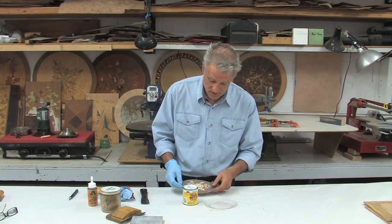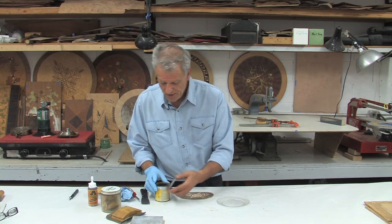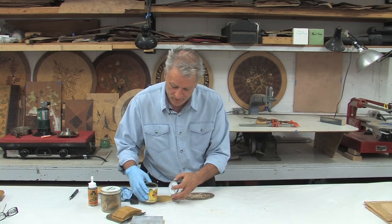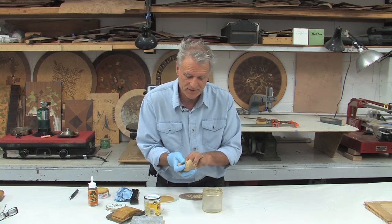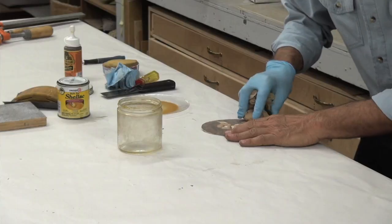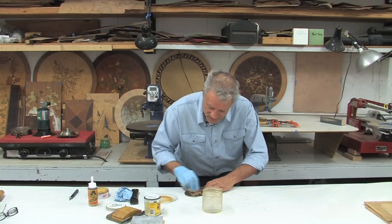Now it's time for the final finish. I'll seal up this piece like I do all my furniture with shellac. Shellac is a natural substance, alcohol soluble, and I use this Bullseye Clear Shellac, which is quite good for sealing up my veneer work. It can be applied with a brush or spray, but my preference is with a shellac pad — this is cheesecloth wrapped up in a lint-free cloth, and it just drives the shellac right into the surface. Occasionally if it's too thick I can thin it down with alcohol. In this way I can put on a sealer coat, which will allow me to see any defects or remaining gaps that I need to take care of before my final coat.